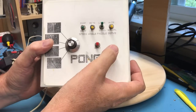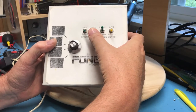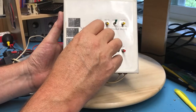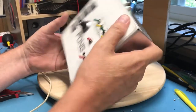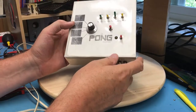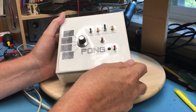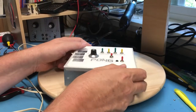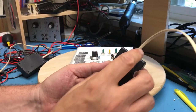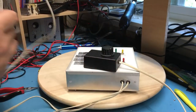It's very much hand-built with nine-volt batteries floating loose in there. There's a very old-school LED that lights up when the power's on, and of course auto/manual serve, large or small paddle. I don't remember what 20/40/20 does, and there's faster/slow speed, and of course you can select the four variants of the game the chip provided. It does have video and sound out. The paddles are simply small project boxes with a potentiometer, a large knob, and a serve button — and of course there are two of them.